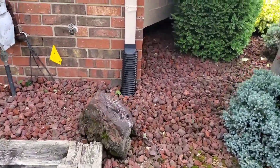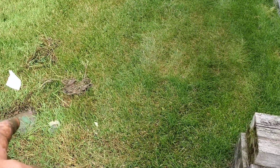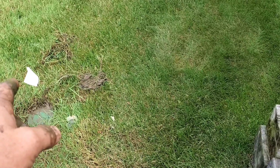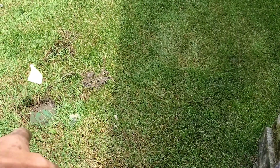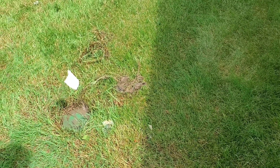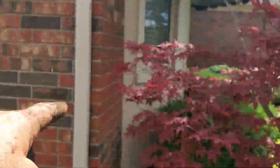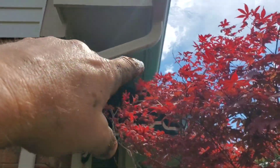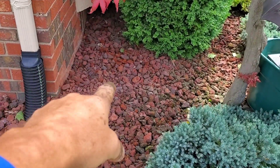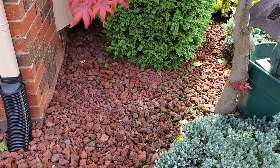We're doing a new system here, but there's nothing wrong because it's pretty new — other than the fact that the grass grew over this and that quit. The system's done, it can't daylight, so the basement floods. When water can't come down off the roof through the underground, it just pours over the gutter trough and saturates right next to the basement wall, then runs down and floods your basement.